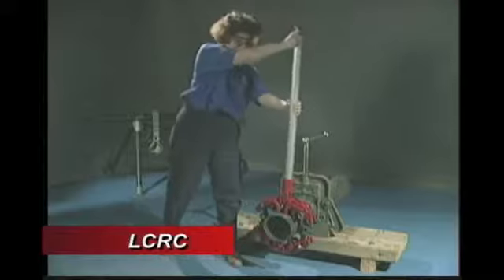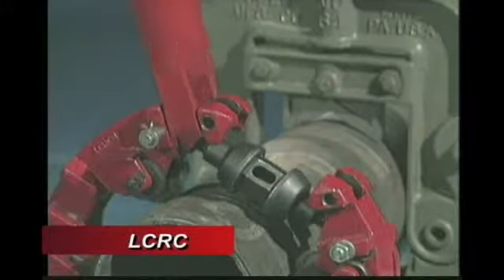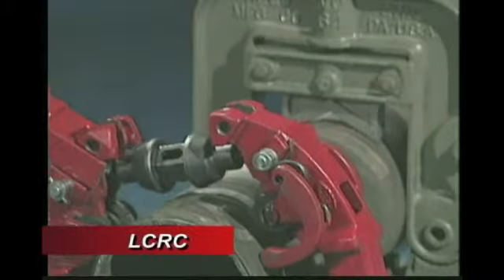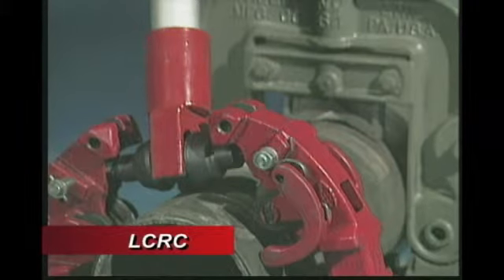Rotate the cutter once to check the wheel tracking path. When you see that the cutter is tracking properly, tighten the turnbuckles every 1⁄2 revolution of the cutter. Tighten all the turnbuckles equally to maintain equal pressure on all 4 cutter wheels for the best quality cut.